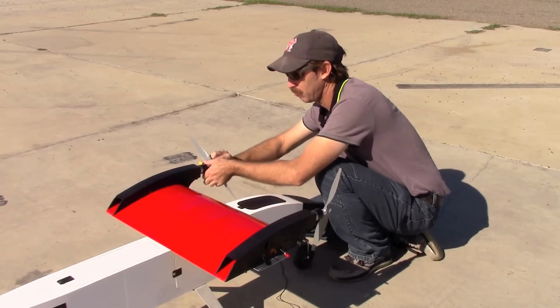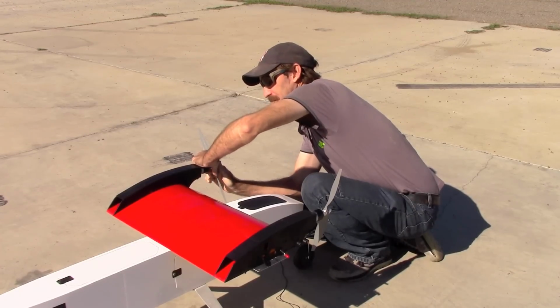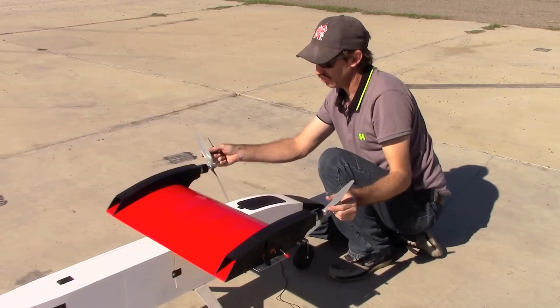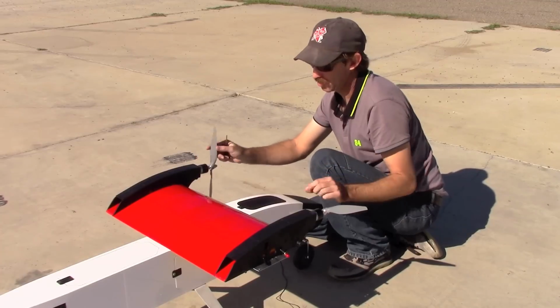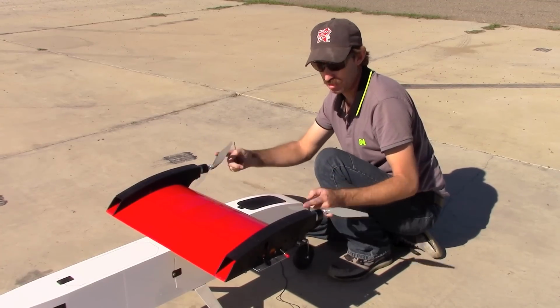Again, grabbing both instruments from both sides, make sure nothing gets overstressed or bent. Make it nice and snug, and we'll just double check visually that the propellers go forward when they're turned top inward. So that's the correct direction.